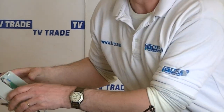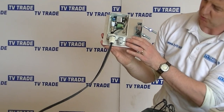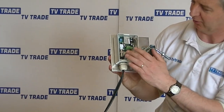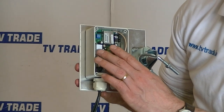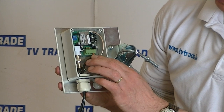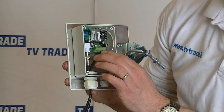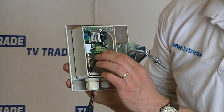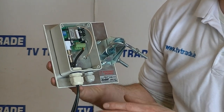And if we look then on the actual receiver side, just grab this cable here. You can see we've actually used our twin cable, with twin power and the RG59. Once again, with a BNC connection, this time taking video out and running it off to a monitor or a TV. And in terms of the power here, we have the choices of audio left and right, which we're not using again. In this case, we just have the ground and the power itself, 12 volt, and that's just being used at the receiver end.